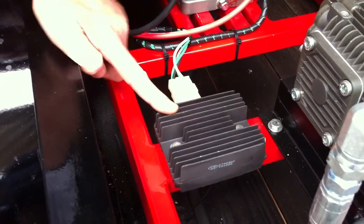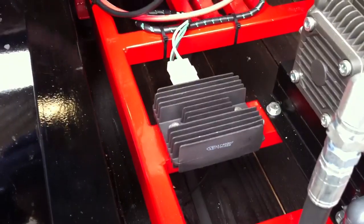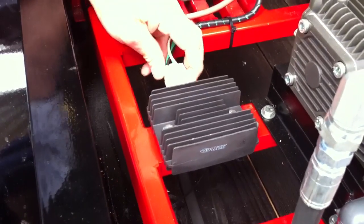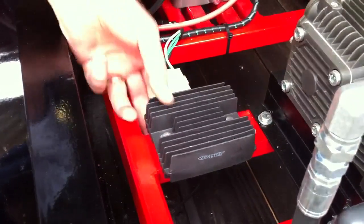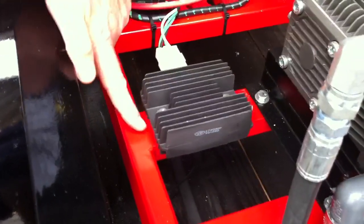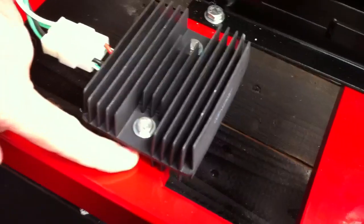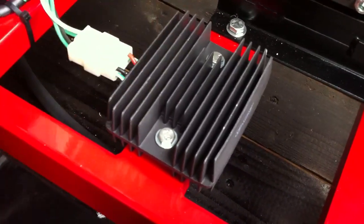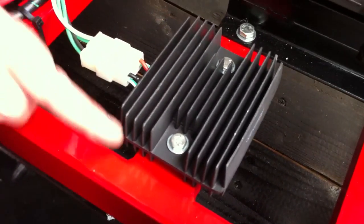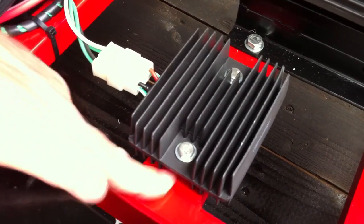We're going to start with a charging system that can handle 16 amps or better for running an ADC burner by Beckett. The abusability is going to be based on how well you anchor these things in electrically. We're grounding this with stainless steel hardware underneath, with a paint-free surface protected with grease, so when it does rain, no water is going to get in there and cause corrosion at the fittings. Stainless steel star washers make an excellent electrical connection to ground.